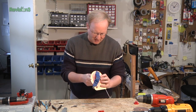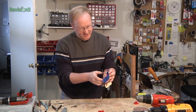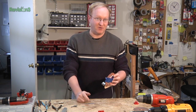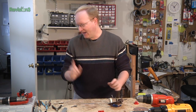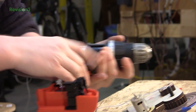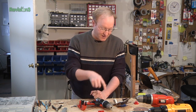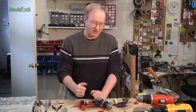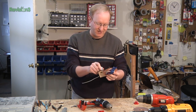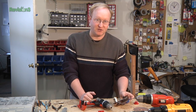I've run into a critical problem. These brushes, while they work, create friction on the spinning disc and this motor is now inadequate. I've got to use a bigger motor in order to make this work. I think we might be able to use a larger motor from a more full-size drill — there's quite a difference. I need to rebuild this frame and put it in to see if that gives us enough torque. The problem is we need both torque and speed but don't have a lot of room. I've got to keep the same gear ratio.